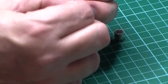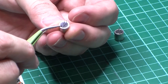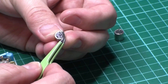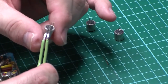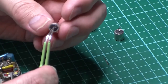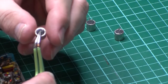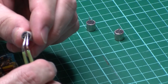Basically that's the pinout: collector is the first one, then the shield, then the base, and the emitter. The shield wire is connected to the actual case of the transistor, and over time little tiny things called tin whiskers grow from the side of the can into the body of the transistor. What that does is create a short between the other wires and the shield. A quick fix is to just snip the shield off, but that is a quick fix and it has been noted in some cases it can mess the alignment of the setup.